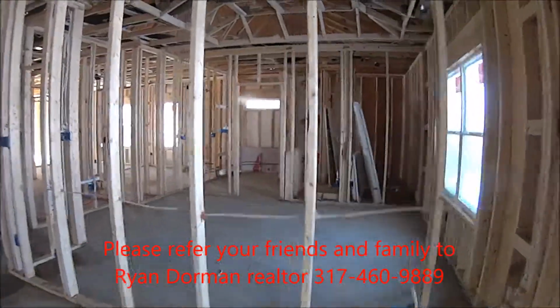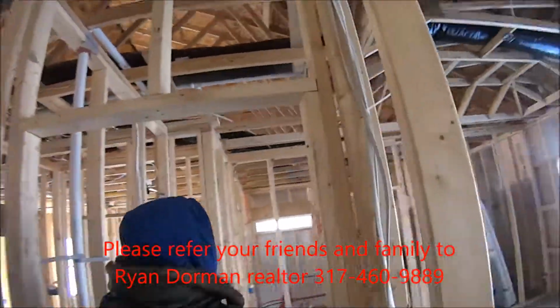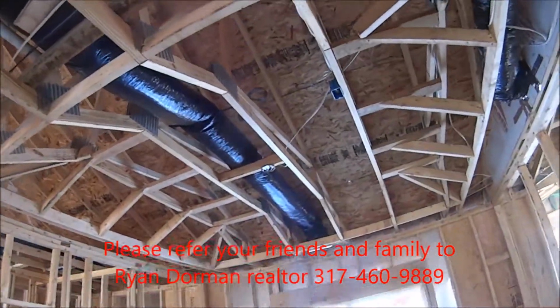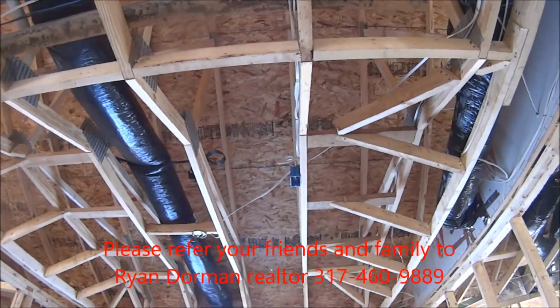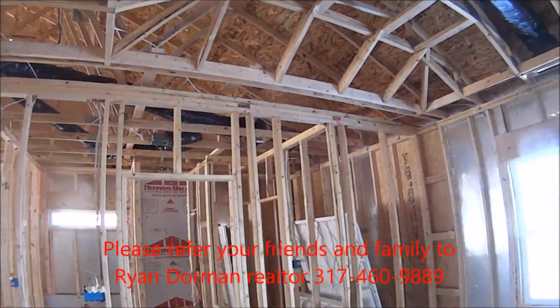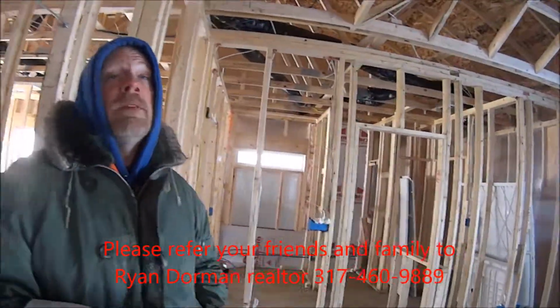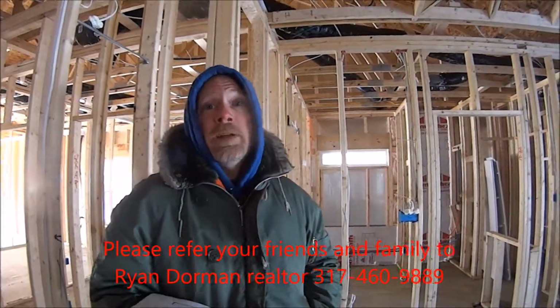As you come around towards the master bedroom, smoke detector in the ceiling there. You got a smoke detector in each of the rooms, and you got one out here by the hallway. They are all hardwired together to where if one goes off, they all go off. And then, of course, they have the 9-volt battery backup that will start chirping at you if the battery's off.